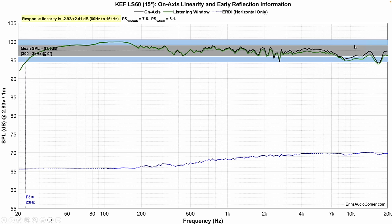What happens if you do what you should do with a coincident driver and turn it slightly off-axis? At 15 degrees off-axis, you can see that that dip mellowed out. The bass adjustments are all the same — it's the same response — but that diffraction dip mellowed out.